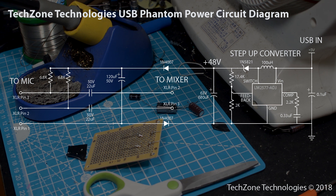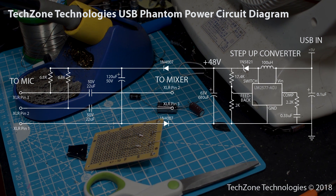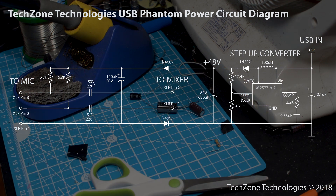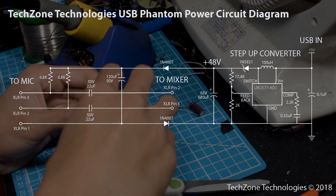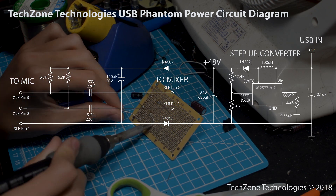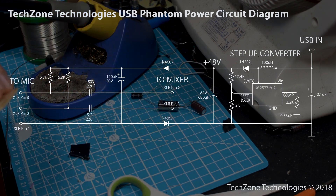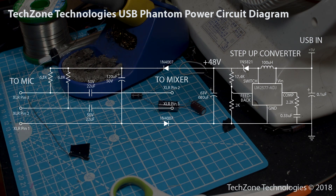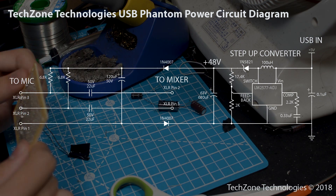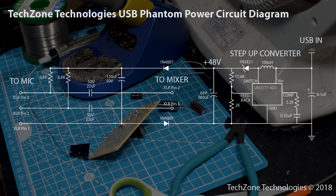Be sure to use quality parts for the capacitors. Two 6.8kΩ resistors are added before the 48V phantom power supply reaches pin 2 and 3 of the XLR cable in order to limit the current if there was a short circuit. Two Panasonic 22µF bipolar capacitors are added to the mic's output for XLR pin 2 and 3 in order to prevent 48V from entering the digital to analog converter. The capacitance of 22µF was chosen to give a -3dB frequency of 12Hz, needed to provide a flat neutral frequency response.